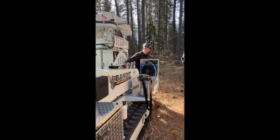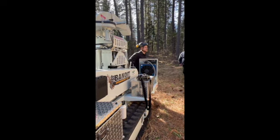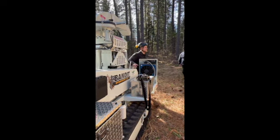Going back, transporting the machine with the clutch in gear, guys, kind of the same idea. Let's say right now, brand new, no wood has gone through. What could happen theoretically, especially going over steep terrain, a lot of hills on it, is as you're going, these plates are going to slowly start to vibrate together. It's not going to engage, but those plates are slowly touching. You're going to warp it from getting those plates hot. You go to engage it, those plates are stuck together. It's not going to engage.